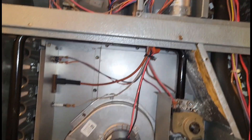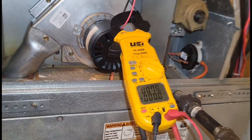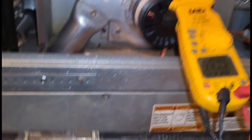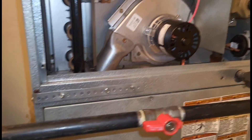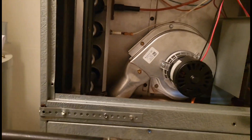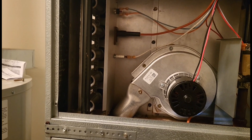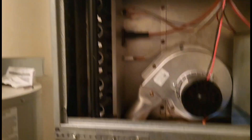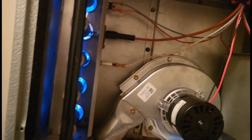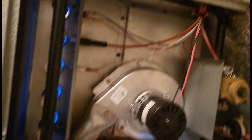I'm going to go back to that thermostat. Alright, I got the thermostat calling now, doors on — let's get busy. I just heard my pressure switch close. There we go — boom shakalaka! Now we wait for our fan to turn on. I got my thermometer already up in the plenum.